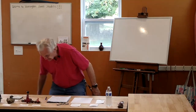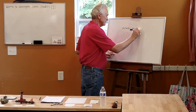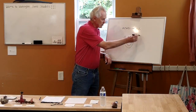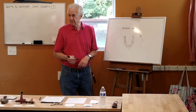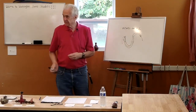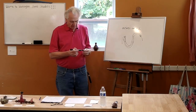There's another unit that you'll see if you look into natural gas supplies, and it's called inches of water column. Inches of water column, I'll just abbreviate it. And what that means is, if you were to take a tube, this is where the term comes from, and you put water in it, like a U-tube like that, and then if you were to connect a hose to this end and push gas in it, the pressure of the gas would raise the level of the water up. And so that's inches, the water column of the water in that little tube. So a quarter of a PSI will raise the water in this tube up about 7 inches. So this is called 7 inches of water column because it's a more sensitive way of measuring very low pressures compared to PSI. But it's equal to about a quarter of a PSI.